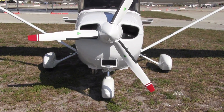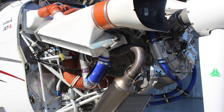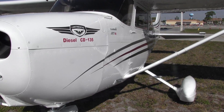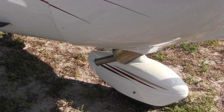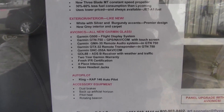What the conversion involves is a custom kit for the Cessna aircraft from the 172F right up to the 172S. When the kit comes to us, it has engine, FADEC, propeller, and everything firewall forward. The biggest thing is that since it is liquid cooled, injected, and turbocharged, the battery has to be relocated from the firewall to behind the baggage compartment. This allows us to go ahead and look at the aircraft right from bare bones to the bottom, and actually work in and refurbish the whole interior because the whole base floor panel is lifted up instead of just looking through small inspection holes.